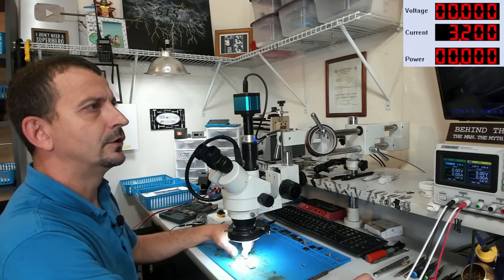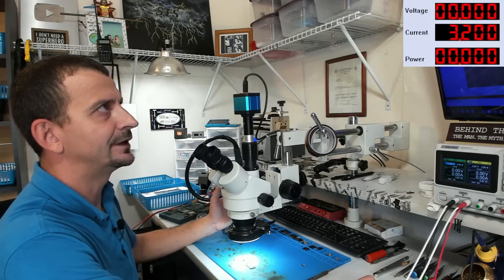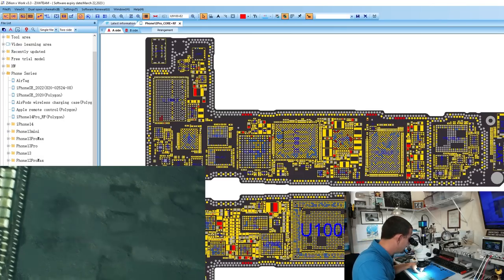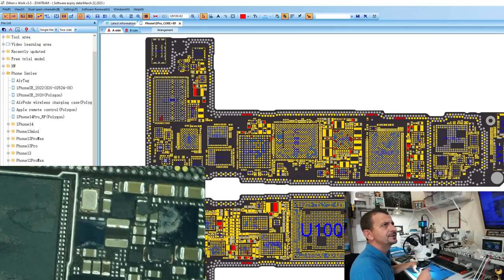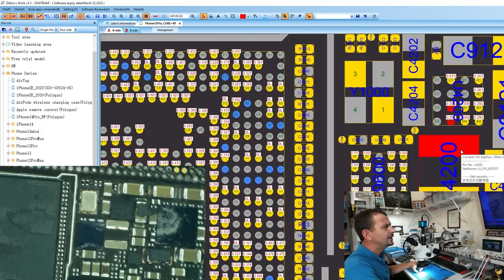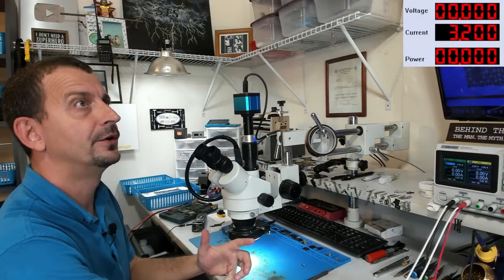So how about that missing coil? Is that going to cause us a problem? Do we need that for data? I'm thinking probably so. Looking at that on the board view here, the missing coil is just below the CPU. We've got one IC and then there's the coil. Zooming in on the board view, that coil is L4200, which is VDD main going to LX sys boost. This is our charging coil. So I'm going to say yes, I will put a coil back in that place,